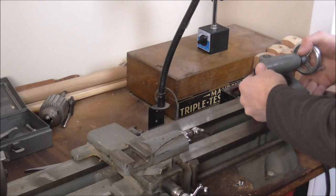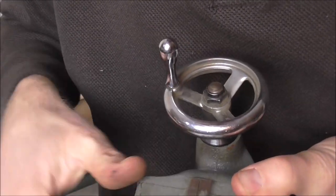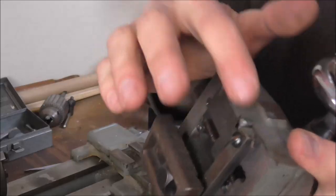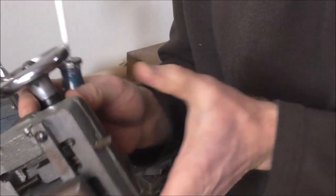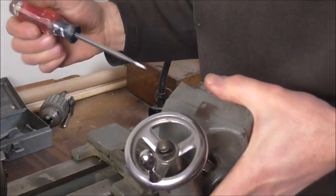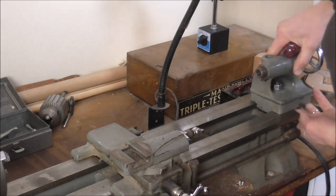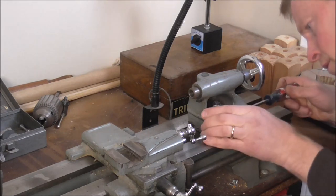I'm going to start by removing the tailstock. You can see how it moves back and forth — that's these two screws right here that I need to adjust. There are two witness marks to line those up. I'm going to line up those two marks and then tighten these screws into place. Another reason why it's loose is the adjustment screws are made so it can fit snugly between the rails. That screw is about where it's supposed to be, so now I'm going to tighten up the other screw. Okay, that's pretty close — I can fine tune it later. Now I'll tighten up these two screws. It seems fairly tight, and probably in the back I can tighten that up just a little bit more.